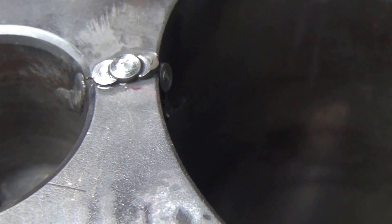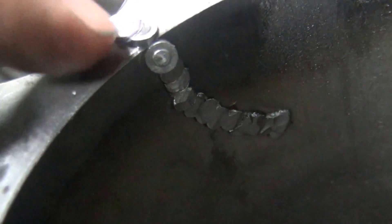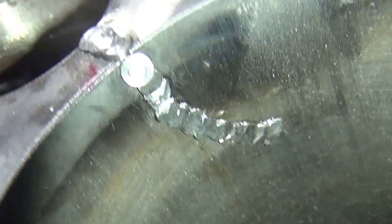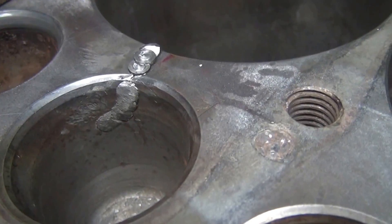After the hole is tapped you can see a little bit of air gaps on the side over here from where it went through the original plug. Those three are all stacked up on there. So we got four of these good plugs in here — you got the overlap right here on top of the cylinder, which doesn't really hurt anything if that breaks away. We got all our tapered pins all the way down through, the two down inside there. I still haven't peened any of that stuff over yet, so I've got to grind these things down and peen them. We got one more to do on this side, which is going to be the one for the valve seat — going right through there. I'll figure out how we're going to do that and we'll do that one next.